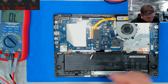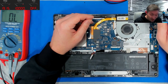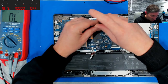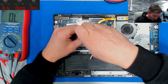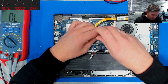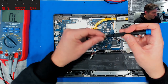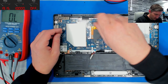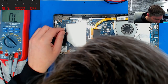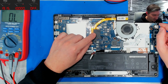Is it an i5 or not? Is it an i5? I thought it is a Pentium. Really? I was already discussing with the customer. No. I thought it is a Pentium. I want to know it now. A Pentium. I think a Pentium comes with a system on a chip design. So a BGA with one die. And the customer persists to tell me that it is an i5, eighth generation. This would mean we have a second die on top of the BGA for the PCH.